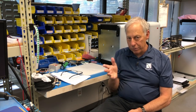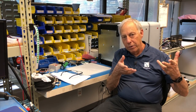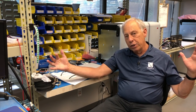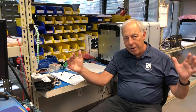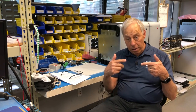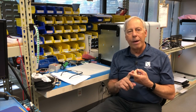So what we did is we came up with a scheme — and a few companies doing this each have their own approach. Our player decrypts the signal because it has that Sony chip, but then we grab it before it goes into analog and we send it over HDMI — but it's an HDMI cable using our proprietary I-squared-S format. It has to handshake with our DAC, so our DAC — which is converting it to analog — is the only thing connected to that raw, unprotected data stream. That way we protect and honor Sony's copyright laws, which, if we didn't, would be an injustice to the musicians and would get us in trouble legally. So that's why.